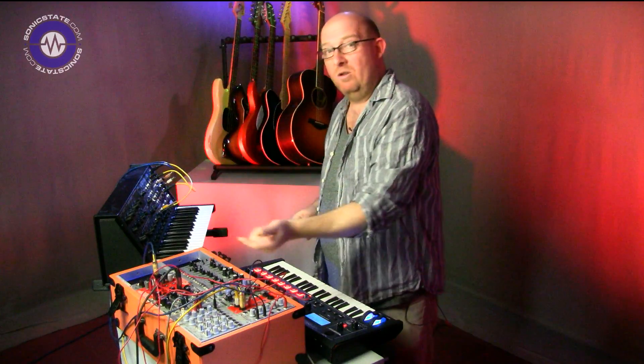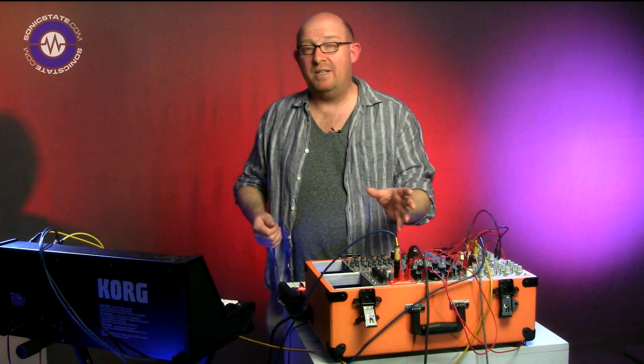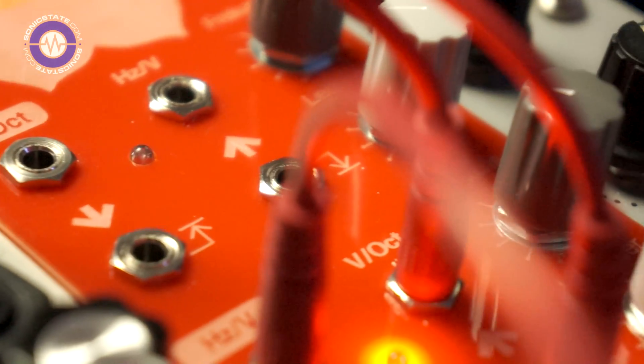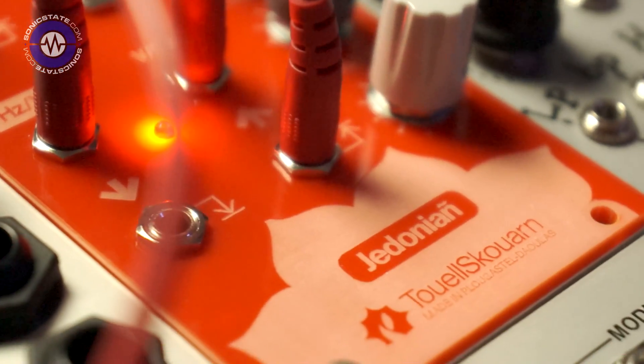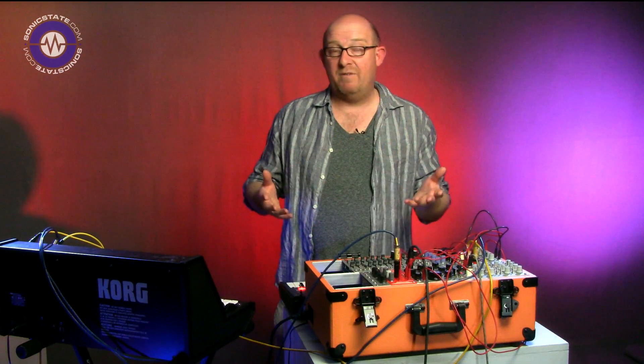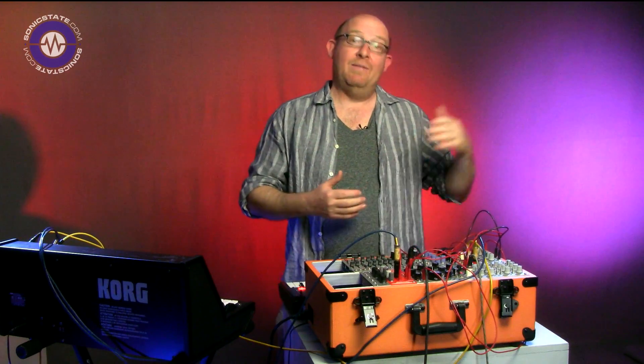Got there in the end, but going the other direction is a lot more fiddly — there's a much tighter sweet spot. I spoke to the manufacturer and they said it's just the nature of the exponential curve being much narrower going from volt per octave to Hertz volts. It works in both directions, though obviously a little trickier to set up from Eurorack to MS-20. It looks quite stylish too. The price is 140 euros including VAT in the EU and UK. If you're in the States there's an alternative: the Harvestman English Tear, which does pretty much the same thing and may be a bit cheaper due to import duty. Thanks for watching, please subscribe!